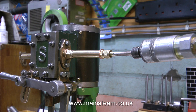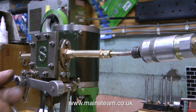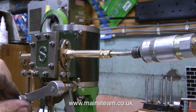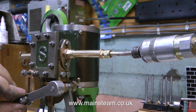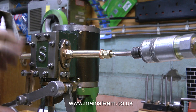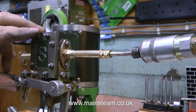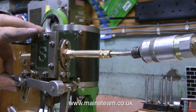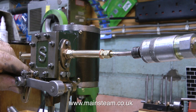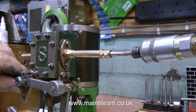I'd like to briefly speak about notching up — I mentioned it in the last episode and have had quite a few inquiries. Notching up is something you do with steam engines. When you want to run in a forward direction, you put the engine in full forward gear, meaning the lever is fully to the extent of its travel. This gives maximum valve movement in the steam chest, maximum steam admission into the cylinder, a lot of power — and consequently uses a lot of steam. But that's fine, because you need that power to start the engine.